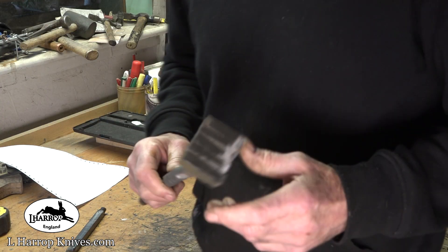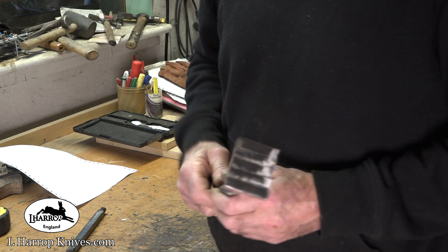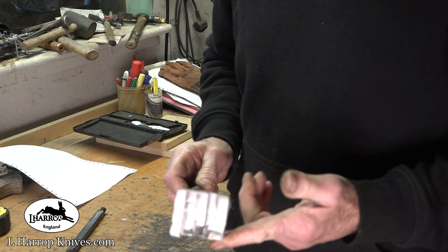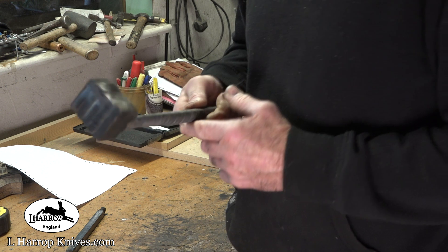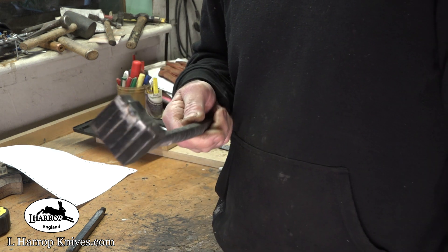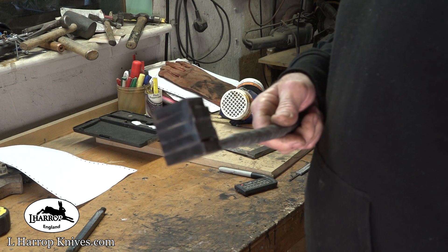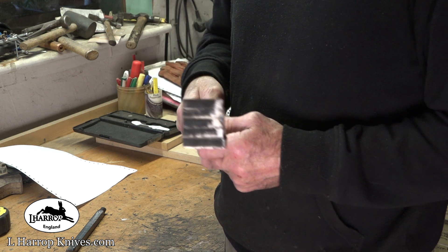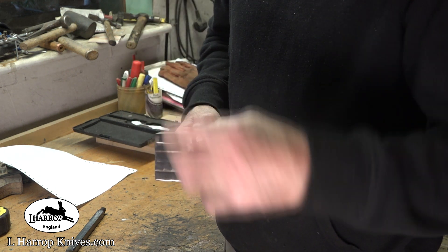That last picture was my layer count, which is approximately 420 layers minus a few that I may have lost through surface grinding. I've just reoriented the stack because I'm going to cut the stack once I've forge welded this stack together with another stack of five — 420 layers. A feather Damascus is actually a mosaic Damascus because what you're looking at is the end grain of the Damascus.